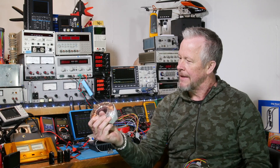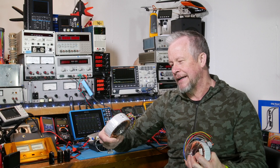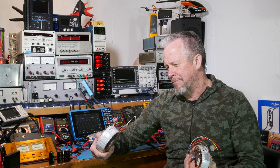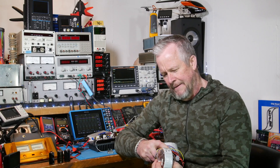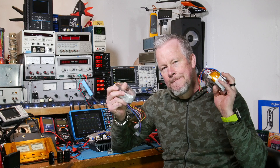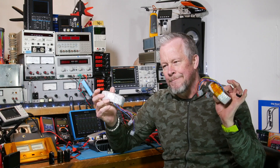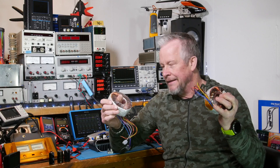For instance, this one is the 160VA and this one is the 250VA. They're both capable of the current — five amps per rail on this one, three and a half amps on the other. This one is 22 volts RMS, that one is 25 volts RMS, both rated at 115V, but US power is really about 120, so it's a little higher.